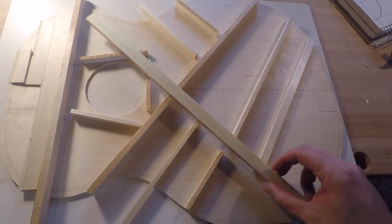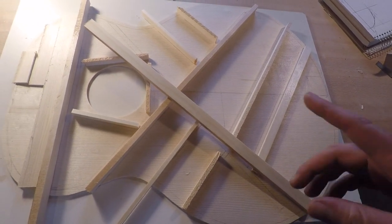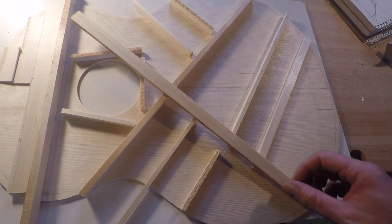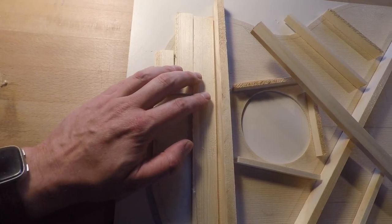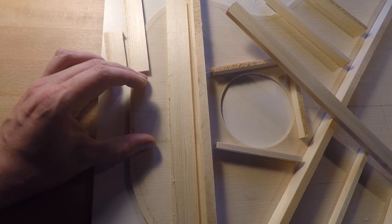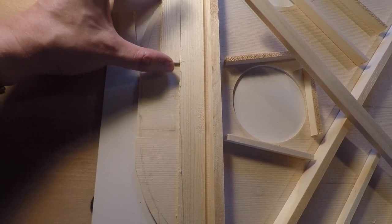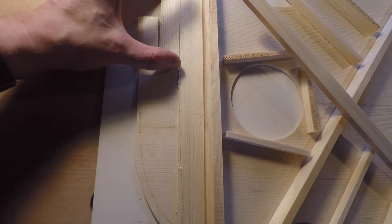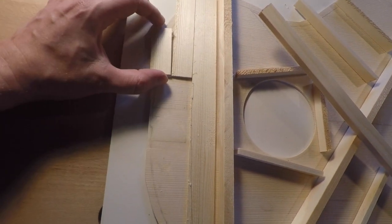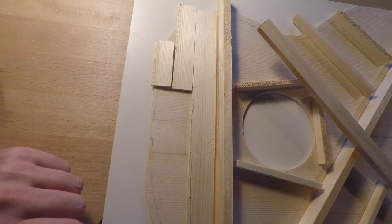So we are going to draw the curve on all the braces, and then we are going to shape them in the right form. So over here are 3 plates. The big one, this one, was already on the plan. It needs to support the fretboard together with this brace. These 2 pieces we'll need as a gluing surface for our scooped cutaway. Thanks to Nick Benjamin for the assistance on how he builds his scooped cutaway.